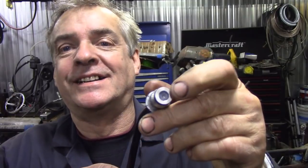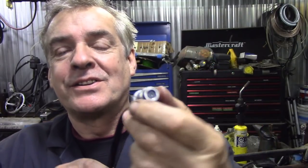Think about that. Inside here there's a little valve, so when you push this inside the pipe that goes to your release bearing and slave cylinder, because it's one of those things that's integral with each other, if you see what I mean. So it's a clutch bearing and a slave cylinder, and there's two little pipes come out the side. One's for bleeding and one's for attaching this to. And this was the problem.